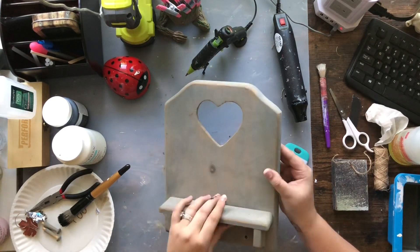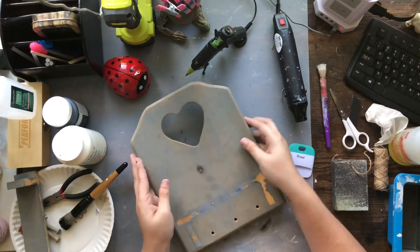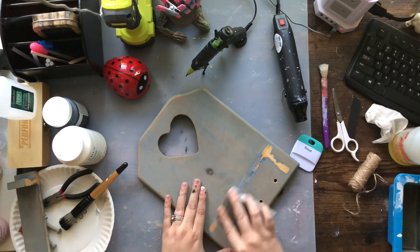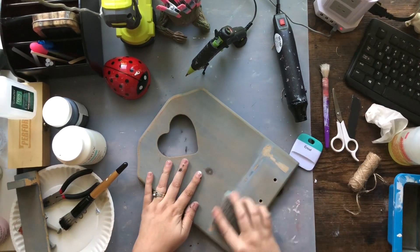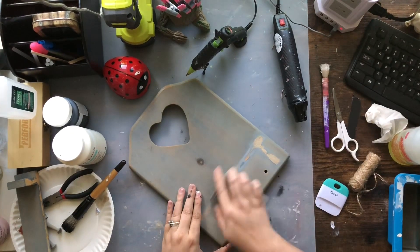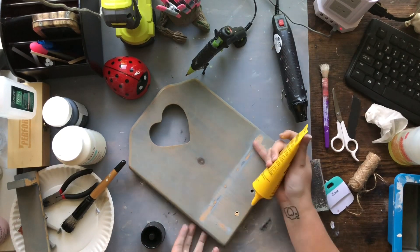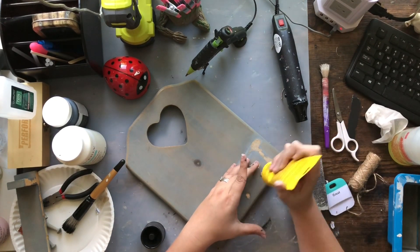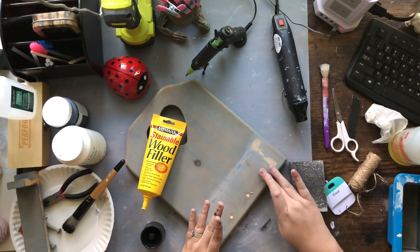The next step: I also received this little shelving piece — I think it was used to hang things. It was missing one of the hanger dowels, so I pulled the rest of them out and that little shelf popped right off. Whoever made this initially just used glue, no nails, so it easily came off and sanded down nicely. I'm taking some wood filler I had on hand and filling up those little dowel holes at the bottom, since I didn't plan on reusing them.